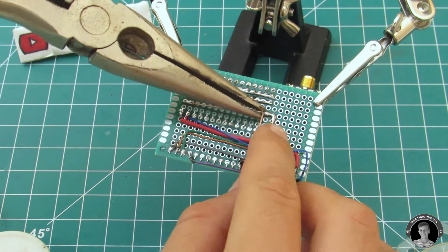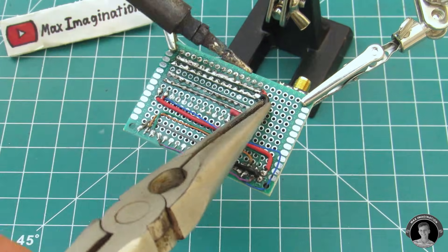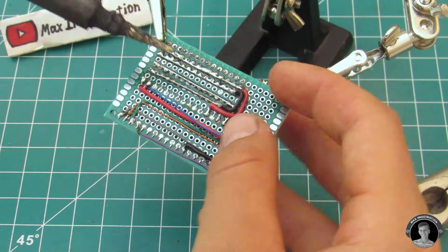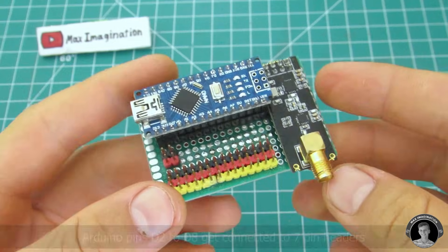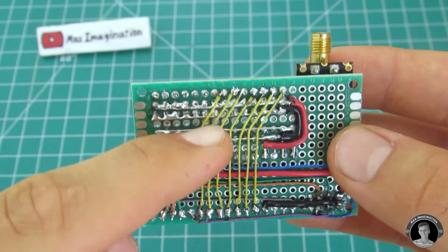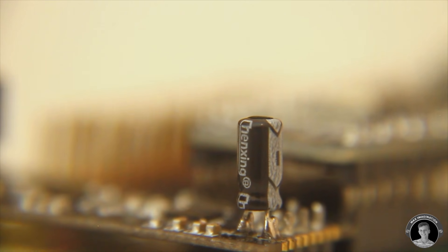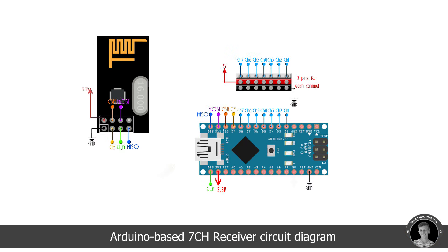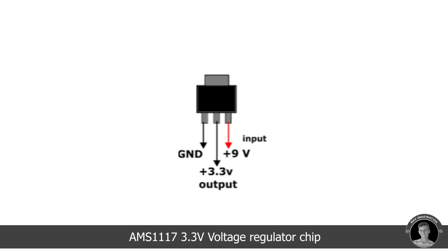Finish connecting the input pins up to the Arduino's voltage-in pin and ground pin. Connect the row of black pin headers to ground and the row of red pin headers to 5 volts. Now hook up all the remaining digital pins to the yellow pin header strip. This receiver is wired up for 7 channels. Just like with the transmitter's RF module, bridge a capacitor in parallel with the power input pins. Here's the circuit diagram for the receiver. If your RF module isn't getting enough current from the Arduino's 3.3V output, use this alternate diagram with a 3.3V regulating chip.